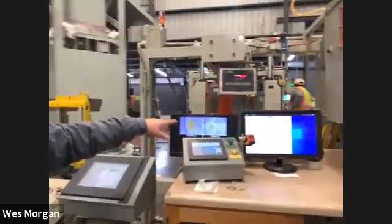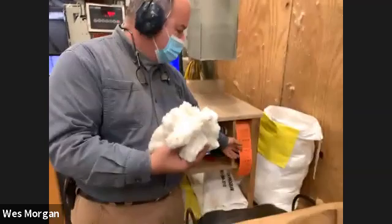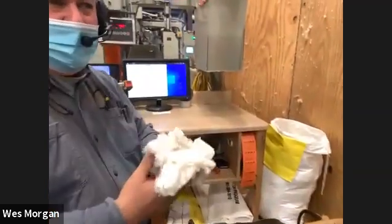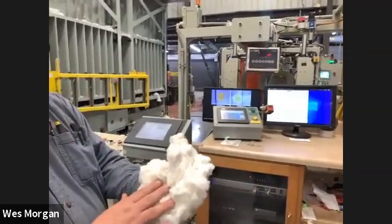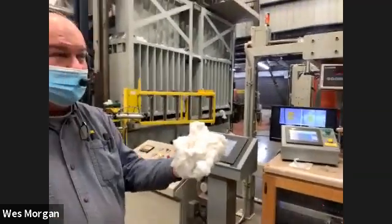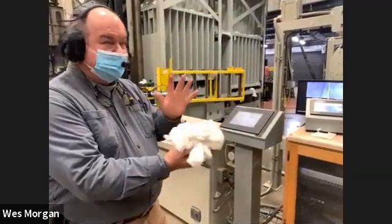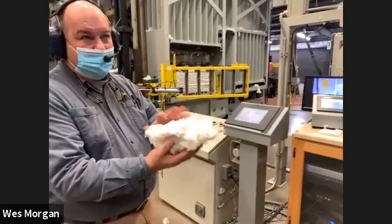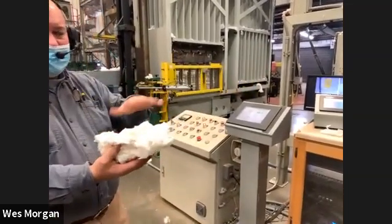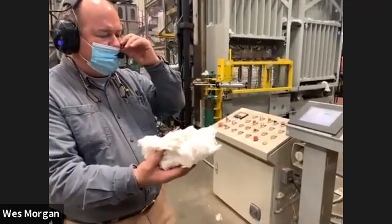See the list of bales there, and we check to make sure the labels are the same. And then he'll take this, and he'll put a sample card with it, and we'll send this sample to USDA to get graded. They grade it for length, strength, color, density, and uniformity. So it gets graded on about 5 or 6 different properties, and then the farmer will get paid for that, whether it meets the grade, possibly a little above, definitely get docked if it doesn't meet the grade.